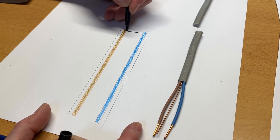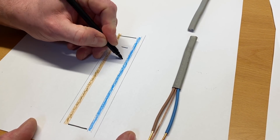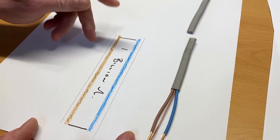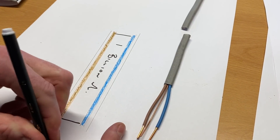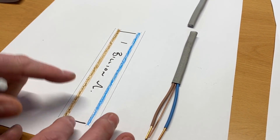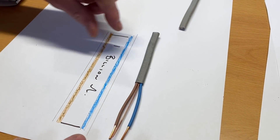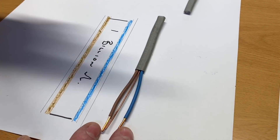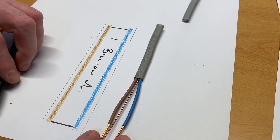So if we put that resistor in — let's say 1 billion ohms of resistance between the conductors — our machine wouldn't read that high, but the insulating material is not perfect, though it's absolutely fantastic. So that's our first cable: we measure between live conductors and, if we could read it, let's say it was 1 billion ohms of resistance — a fantastically high value.